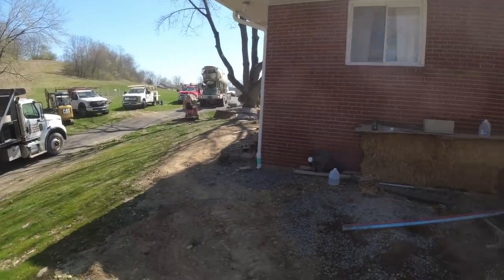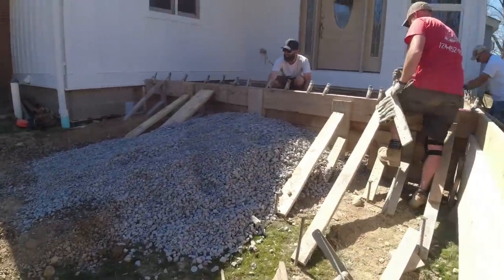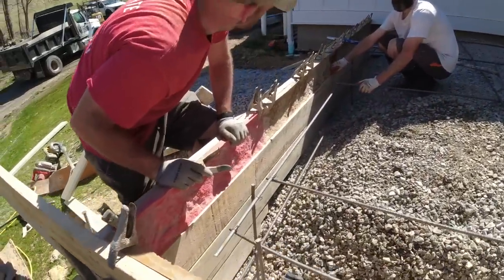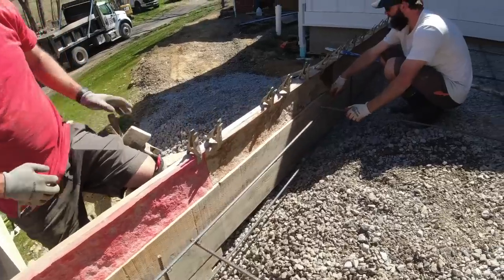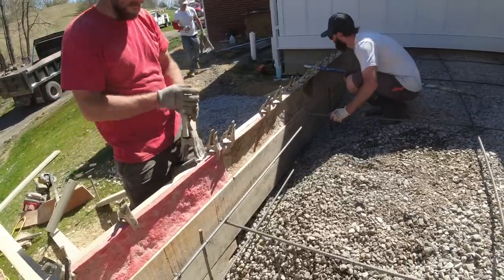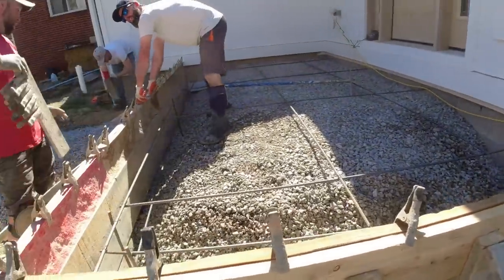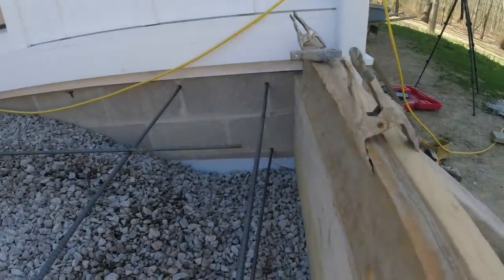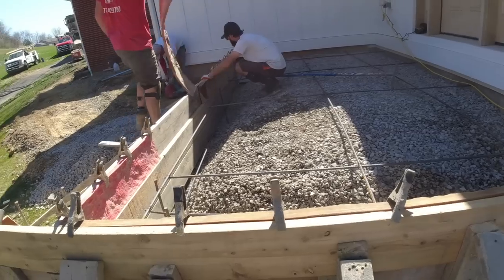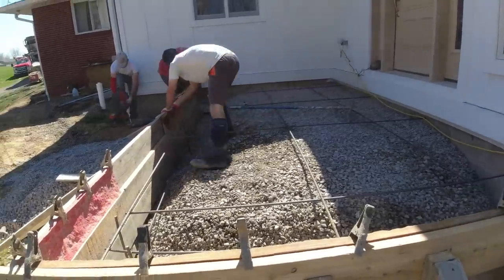Pulling the mixer into place — we're going to power buggy it up. I made a ramp right here. Right up, rotate the bucket, keep the tracks nice and straight. Clamping our step liner in place — adjusting the seam right in the front, looks like it's going to be right there. Okay, let's get pouring. There's our rebar grid brought in high and low. This gets a rolled slate texture border — easy, buggy.